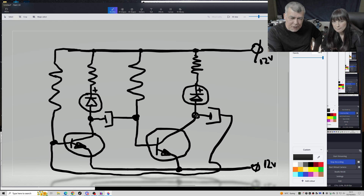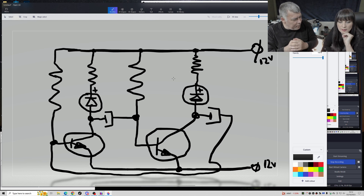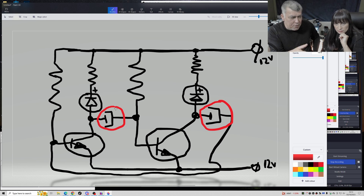When this LED is lighting up, this capacitor is connected to ground because the transistor is driving power here - so you have ground there. When you connect the capacitor to ground, the voltage on the base will rise. The question is: how can we change the duty cycle - the time the LEDs stay on - and how can we change the frequency?